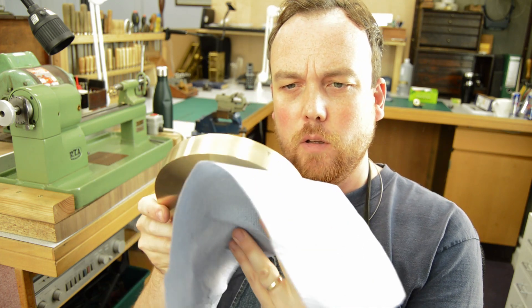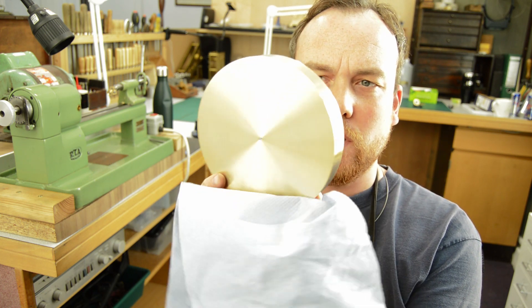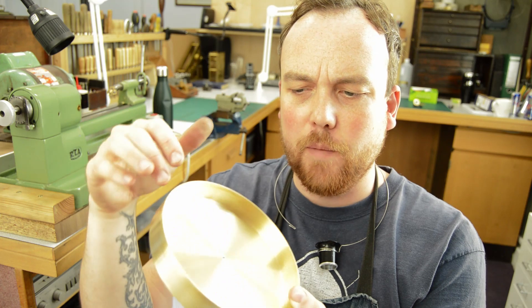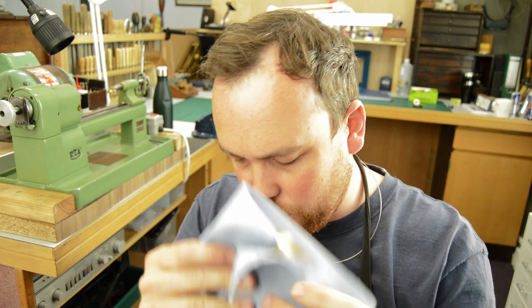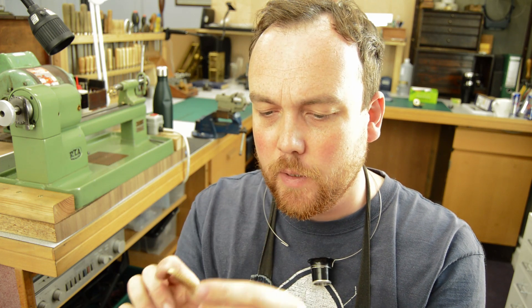At the end of the first instalment we have here the bowl, which I'm pretty pleased with as a good starting point. Fabricated, soldered, flat plate and then machined on the Smart & Brown 1024 — so that's the first component. It's not complete, we've got to revisit it, but it's as complete as it can be for now. In the next episode you'll see how I started to make the train wheels with triangular tooth form. Thanks for watching.